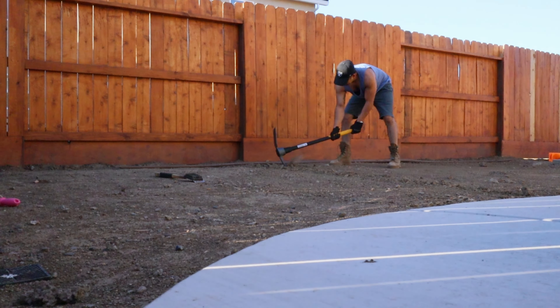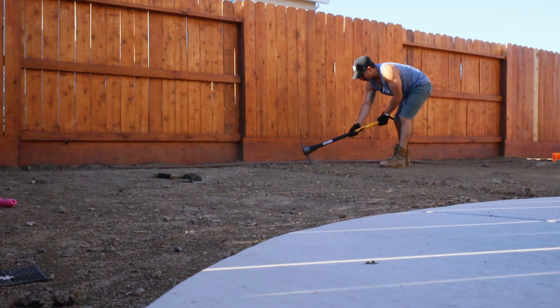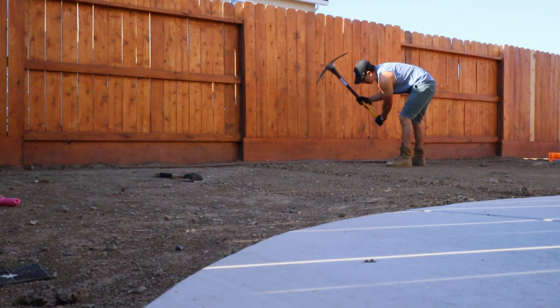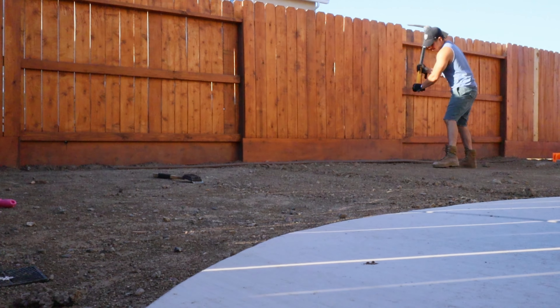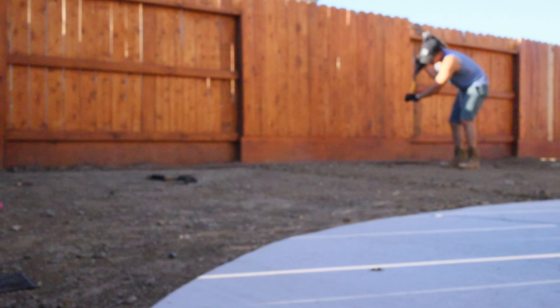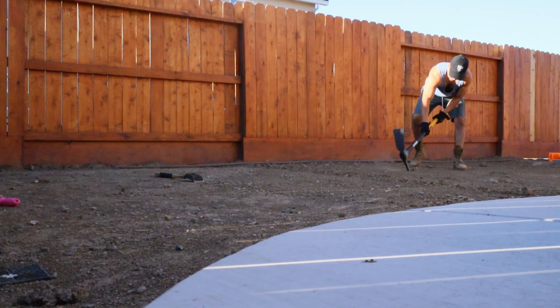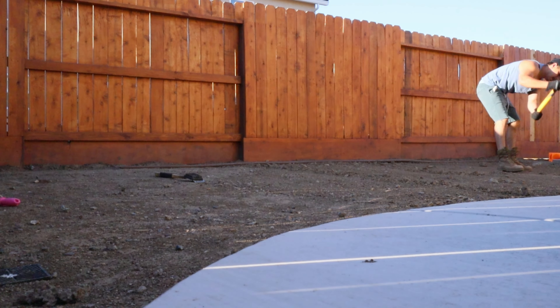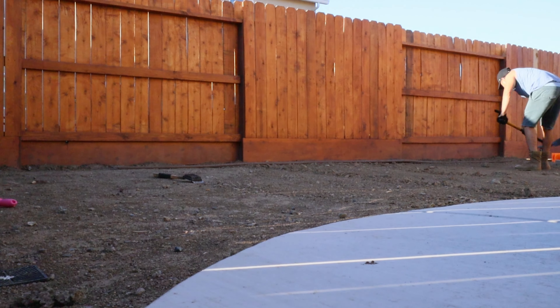In the beginning, I completely failed with the shovel — this dirt wasn't going anywhere with a shovel. So here you can see me pickaxing, and this is bringing out the big guns. You're going to need a pickaxe for hard clay dirt that's really compact. There's no other way around it. As you could see, I'm not coming down with full force because mine isn't too uneven to the point where I need the whole pickaxe to penetrate the ground. I just needed about three to four inches, so I'm not bringing the pickaxe over my head, or else that would have gone too deep.